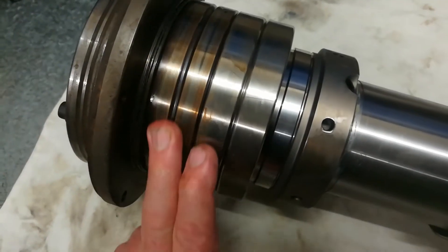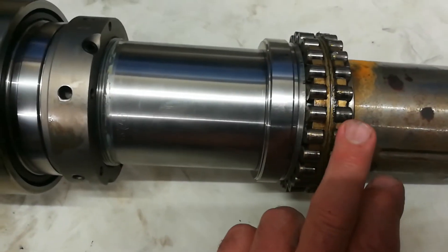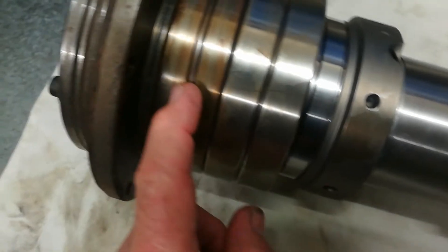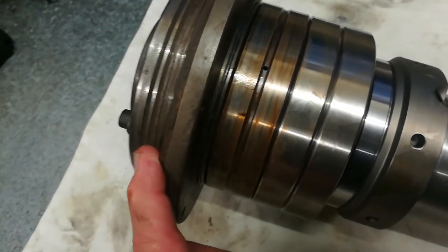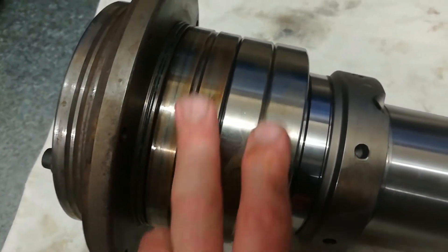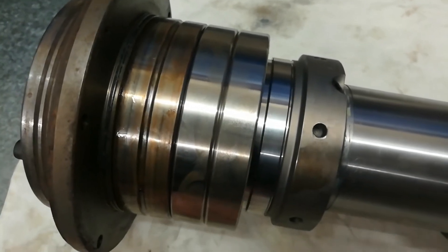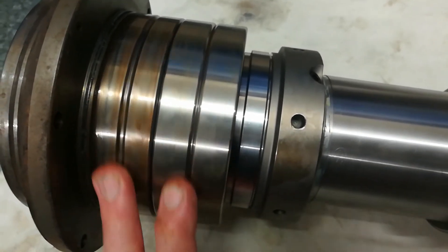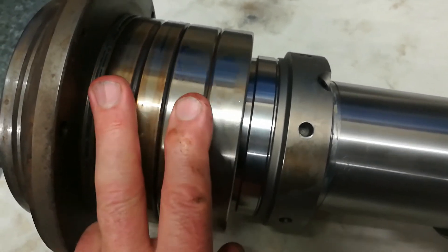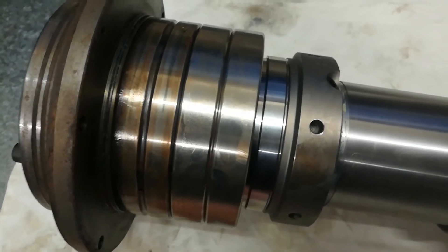I'm not 100% sure if this is another bearing, but it sounds about right - there'd be three bearings in here. This is considered one bearing even though it looks like two, and this is another bearing at the front. This is the chuck end, so this would be the one to cop all the load - a fair bit of high load because the chuck is obviously being forced in lateral, angular, and all sorts of directions. There's a lot of force put into this spindle that you don't think about when you're taking off huge cuts from decent-sized bars.